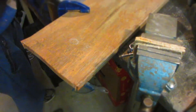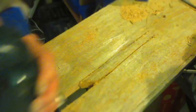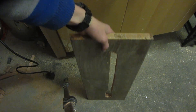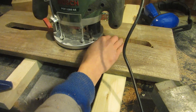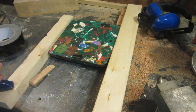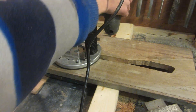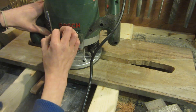To start, I had to make a jig using a piece of veneer wood — I cut a slot for the router bit to run along. I'd recommend using normal plywood or MDF instead, since the veneer wood bent the jigsaw blade and meant I couldn't cut a straight line. The jig is basically a flat piece of wood with a groove wide enough for the router bit. I installed a guide ring in the router to run in that groove, keeping it from straying. The jig sits on two pieces of wood of exactly the same thickness on either side — tall enough to clear the HDPE — secured down with double-sided duct tape and thin wooden shims so it won't rock or move while cutting.